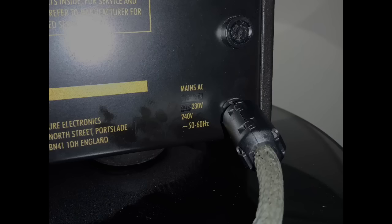I wouldn't put ferrite cores on interconnects because those are likely already shielded — you'd just be adding inductance for no benefit. If you've got captive mains leads, you may want to try putting one at the end where the lead goes into your equipment, as it may help reduce RF and a little EMI coming in.